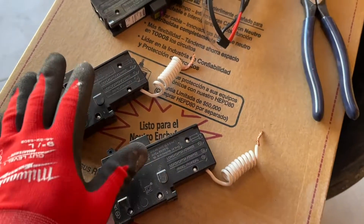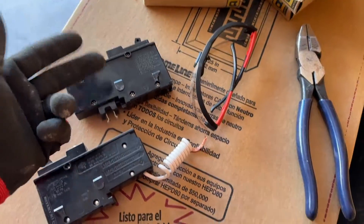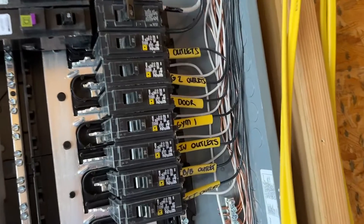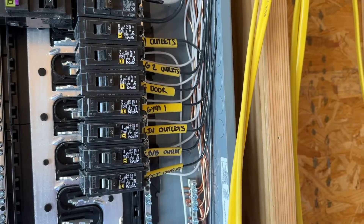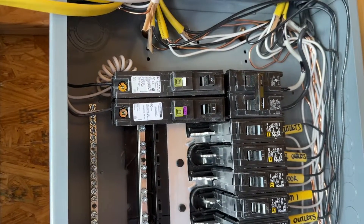So I hope that wasn't too confusing, but I know if you are doing any of these wirings, you might see these two different styles of breakers. You might even see the small traditional styles. These little ones are your regular ones, but these are all dedicated outlets and they have a GFCI as the very first outlet so they are protected. When you can't put a GFCI outlet — like these are going to different light fixtures — that is the GFCI.